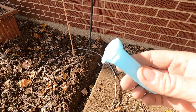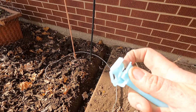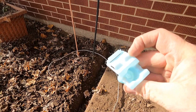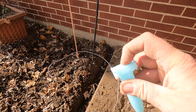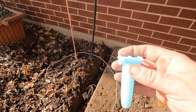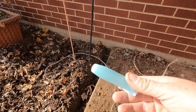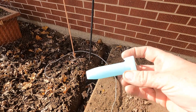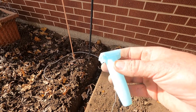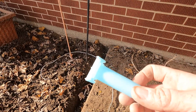So what's included are two cap nuts and two of these things. They come pre-filled with silicone, and you pop them open, you make your connection, throw it down in there, and then you push the cap on, and you do it to the other wire, and then you bury them, and the silicone keeps everything dry. This is exciting to me, because I've done years of home electrical repair and electrical installation, and I never knew this existed. All right, so let's do this real quick.